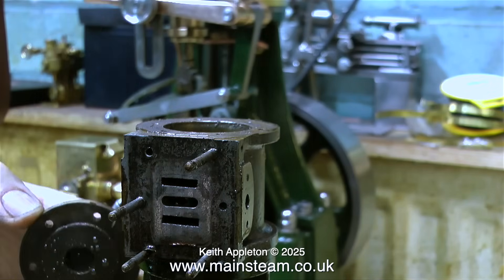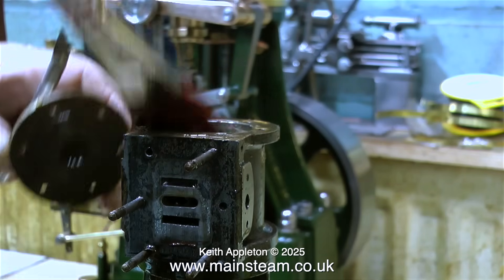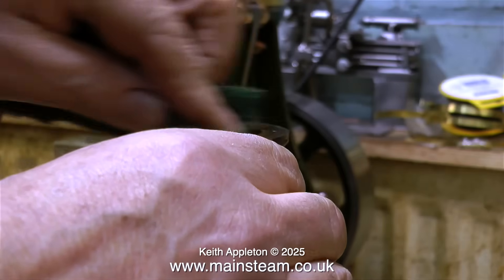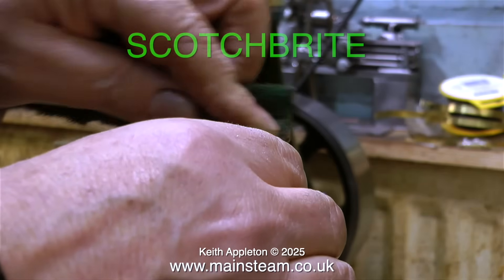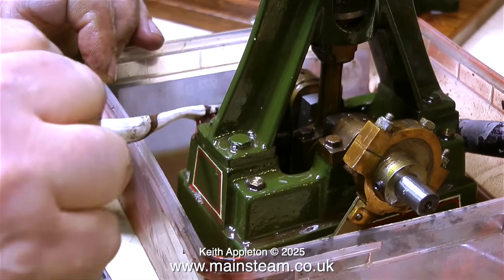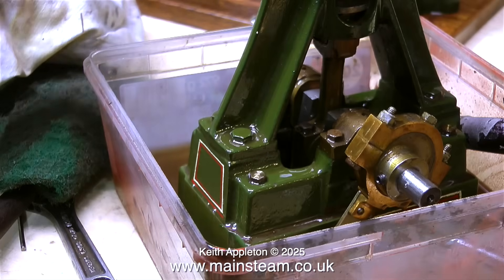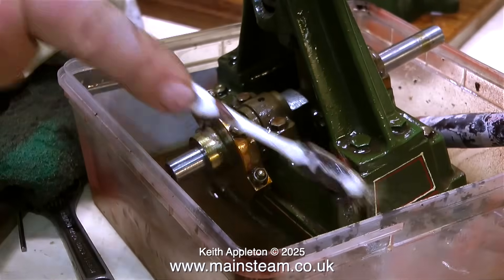The steam cylinder top cover is rustier on the outside than it is on the inside. I'm using some white spirit to clean up the cylinder bore so I can have a close look at it, and the cylinder bore is like glass - this engine really is very well made. As a quick test to see how easy it's going to be to remove this varnish, I'm using a piece of green Scotch-Brite dipped in white spirit. Scotch-Brite is a bit like a scouring pad but a bit more tenacious. Up till now I've been applying the white spirit using a soft paintbrush, which has been okay for most of the grease and grime on the paintwork, but now I need to get serious and get into the corners, particularly around the bolts, so I'm using a toothbrush.